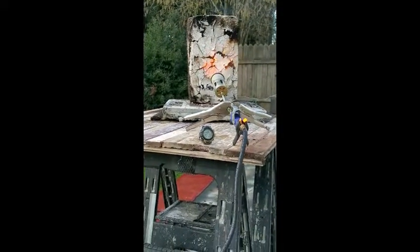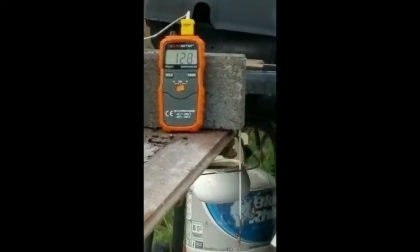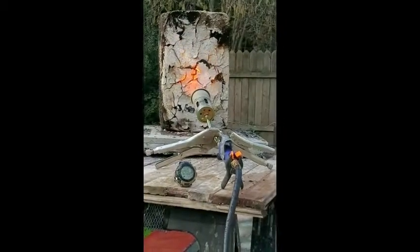Okay, we're at 1621 hours. Core temperature 128 degrees. That's getting quite warm. That took 2 hours to get there. That is still survivable, however, that's extremely uncomfortable. But if you're in a flash fire, comfortable is the least of your worries. This block has been under continual blast from this high-powered torch for 2 hours. If you count in the initial start time, 1400 hours, that's 2.5 hours almost.